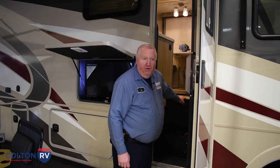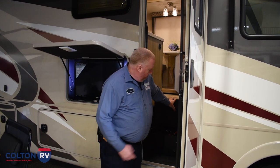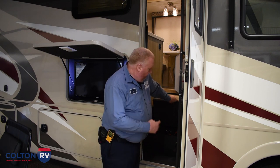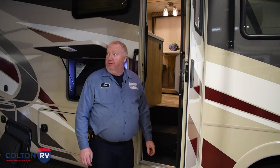Here's another variation to the battery systems. You've got a motorhome that's using more power, so they're using two 6-volt batteries to make one 12-volt battery. What that means is you get a longer run time and better use of your inverter. You'll have to pay very close attention if you're going to try and change the batteries yourself, because they're wired positive to negative, negative to positive, and you pull the power off both ends. It's something you have to be really careful with, paying attention to how you take it apart.